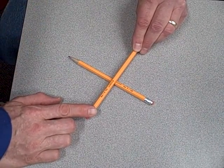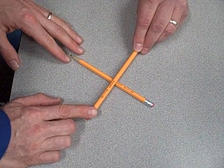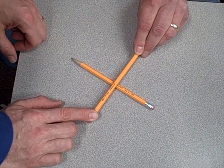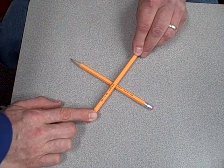So together we are a force balance system. Right now, with the fulcrum in the middle, we have roughly equal forces required to balance that pencil. If I push down with two pounds of force, he's got to push down with about two pounds of force to balance out, because we're at equal lengths — equal moment arms in that lever.